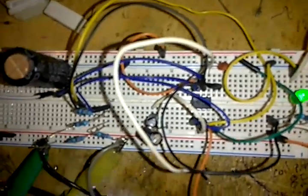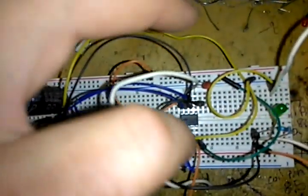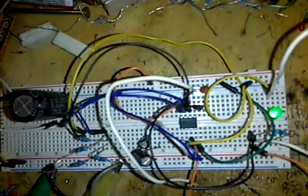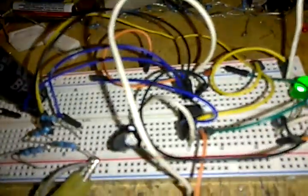If you'll notice, I've got pin 1, negative. My pin 2, right here, goes to my jumper wire here to the negative side of the capacitors. One's a 100 microfarad 50 volt, and the other one's a 47 microfarad 25 volt, and it doesn't matter about the voltage on this, I'm just using them for their capacitance. You know, how long it takes to build up before it spits out the power,